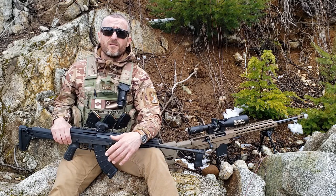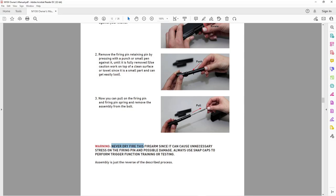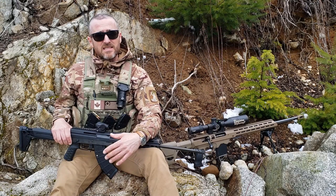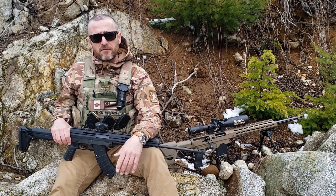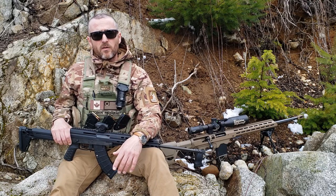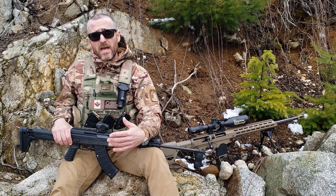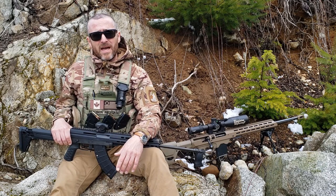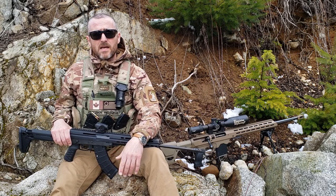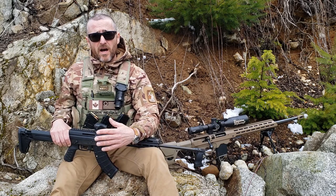I've seen multiple reports of gas pistons breaking, bolts breaking with lugs shearing off, bolt lugs peening and headspace increasing. If headspace increases due to soft metal, eventually the bolt will close on a no-go gauge, which means your rifle becomes a grenade and could potentially explode — some of these problems are very serious. Another common issue is broken firing pins. The rifle's owner's manual warns in uppercase letters to never dry fire the rifle, but that doesn't make any sense because they chose AK pattern magazines which have no way to engage a bolt catch, meaning you're going to dry fire it every single magazine.